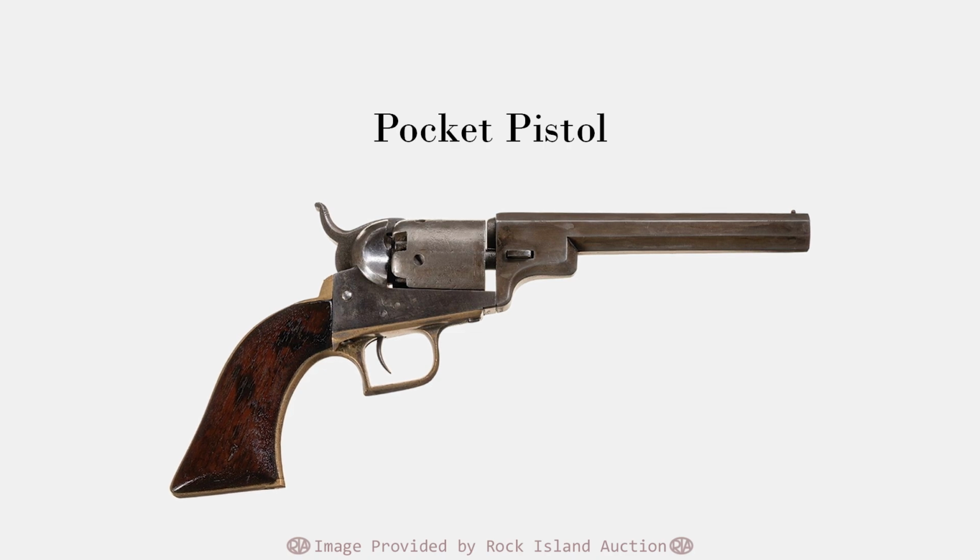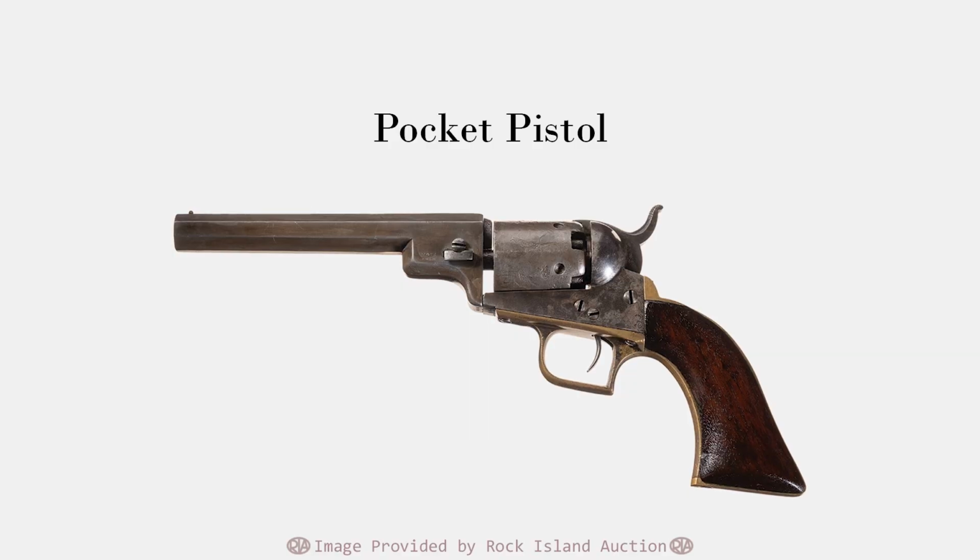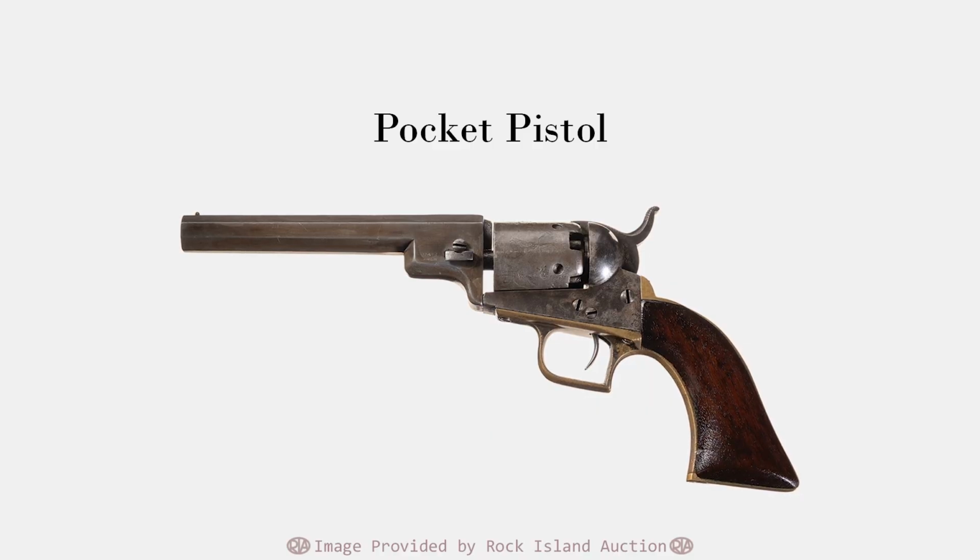However, it's worth noting that these were silver plated from the factory. It's just that over time, most have worn out, revealing the brass. While we're talking original finish, the barrel, cylinder, and screws were blued, the frame and hammer case hardened. The trigger guard was square backed, just like the same on the Walker and then current early Dragoons.